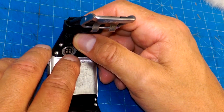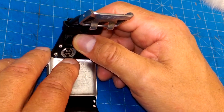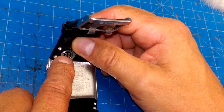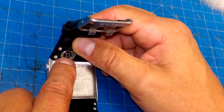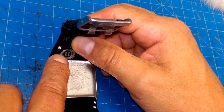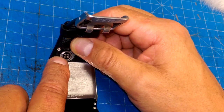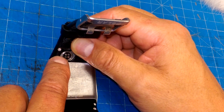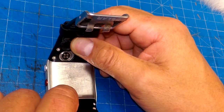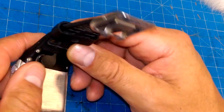The replacement charger will have the correct pinout for D-plus and D-minus, which I haven't figured out. But I do know that you've got either positive on the top and negative on the bottom - the left-most two pins are power. You can determine the polarity depending on how much current draw you get when you throw a power supply on it. Since all of these are 5 volt, you don't have to worry too much - just limit your current on your power supply and you can ring out those terminals.